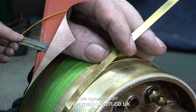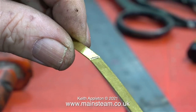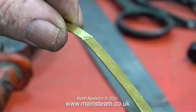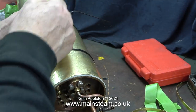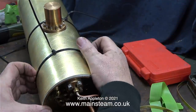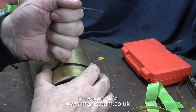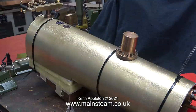It's time to make boiler band number two. For the rest of the bands I'll use my ruler and cut them to 16 and 1/16 of an inch. Once I made the first boiler band that fitted perfectly I thought it would be a good idea to use nylon cable ties. One was insufficient, but when I put two together there was sufficient length to wrap around the cladding and still have enough to pull it tight. I ended up fitting quite a few of these tie wraps.